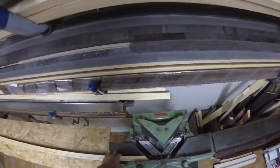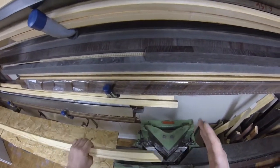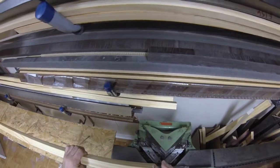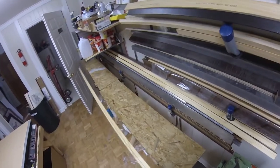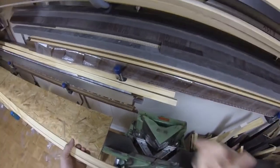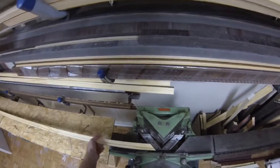If you use a chop saw, that can sometimes work just as well. Just make sure it's not moving when you're chopping it — good and steady when you make your cut. If you end up with any weird burrs or tattered edges, take something with a perfectly flat plane and sand it off. A disc sander works really well, or a sanding block. The idea is you want that plane of the miter to be perfectly smooth.